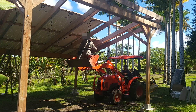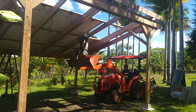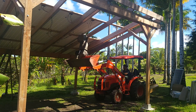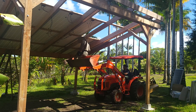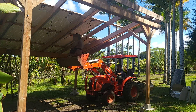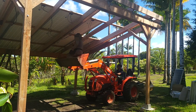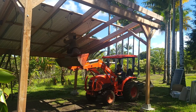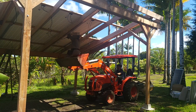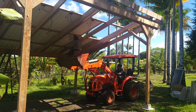Other methods I might consider for waterproofing would be a roofing mastic or a wet patch, which comes in a can or in caulk tubes. Another option could be waterproof repair tape also used for roofing, applied in strips. The butyl tape we used was one and a half inch wide, but with these panels when butted together it would have been more ideal to use a one-inch or even three-quarter inch tape. I originally bought the inch and a half wide tape thinking I'd use it to bridge the gap with the lag screws. In a future video we'll look at the actual butyl tape on top of the roof.